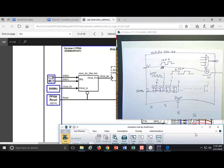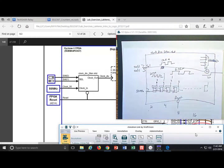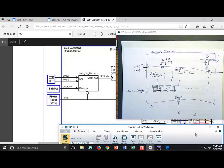A toggle flop is a D flip-flop with QN wired back to its D input — it toggles on every rising edge, dividing the clock by 2. Chaining them builds the ripple counter. You'll have 38 versions of the clock and pluck off four of them. The component is called clock_div, with select lines from switch 0 and switch 1, input clock_50, and a reset.